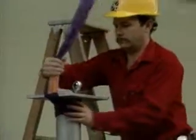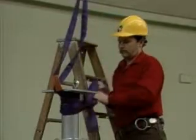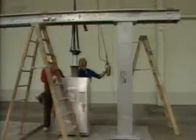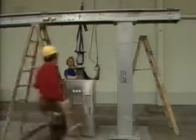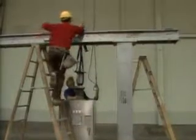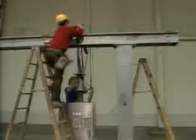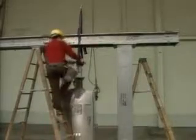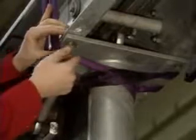Reposition the lifting sling around the front of the stored energy mechanism. Wrap another lifting sling around the back of the mechanism. Move the operator alongside and nearly under the crossbase, making sure that the operator door faces the same way as the switch position indicator. Reposition the slings so they straddle the crossbase. Carefully hoist the operator into place. Be careful not to damage the uniball coupling on the operator connecting link. Attach the operator to the underside of the crossbase. Securely tighten the hardware.